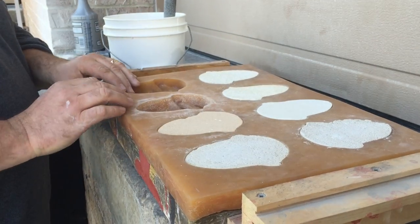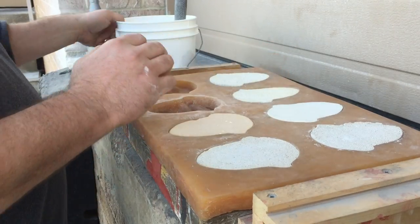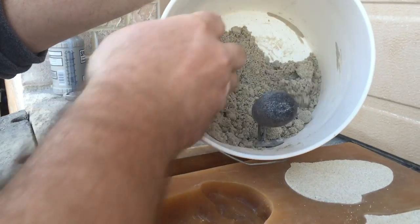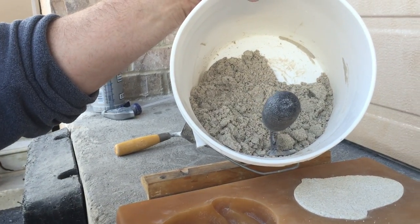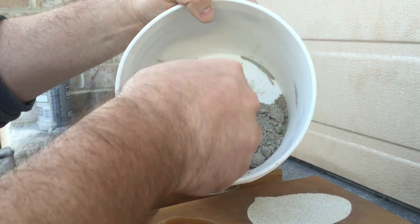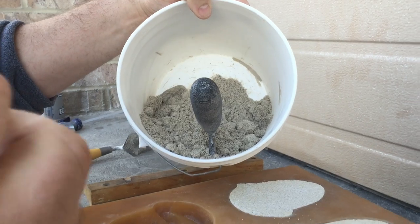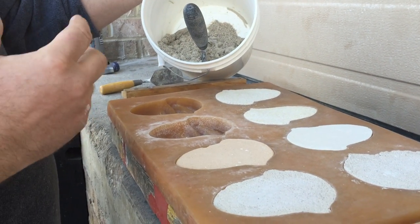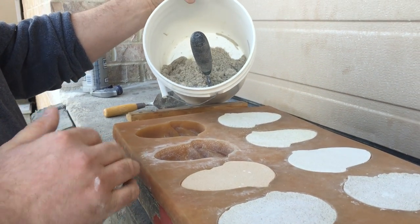We have our piece, our mold made, and the casting is ready to begin. I mixed up some matrix mortar. The mortar itself is not mixed up the way you would for patching — it's dry and sandy. It uses less water than you would normally use, just enough water to start the hydration process, but not so much that we're not going to get a good finish on the cast.